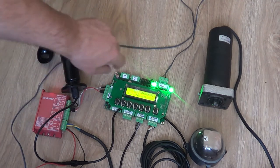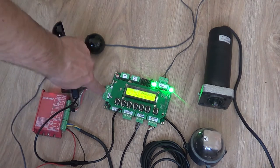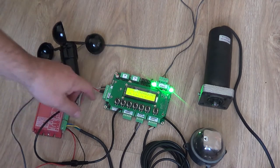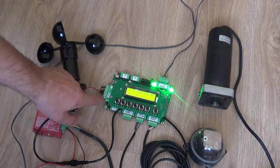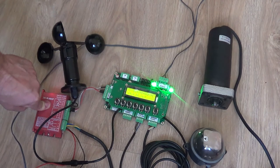for powering the DC motors. We are removing the fuses. BLDC has its own driver, external driver, so we are moving the external channels to control it. It's important to see that plus is not connected. It's not connected because we are not moving any power between those two drivers.